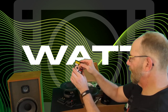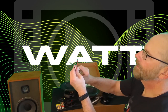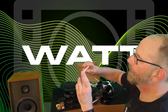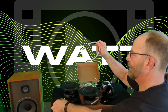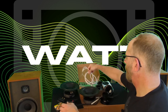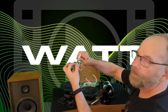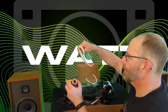For wiring I typically use Audtech 99.999% oxygen-free 14-gauge twisted wire from Parts Express — it's really thick and I've got just enough to jump from the terminal cup to the crossover. Then to feed the drivers, I've got Honeywell 16-gauge four-wire cable. I'll use the black and red for the woofer and the green and white for the tweeter, and solder these guys. I've got just enough for both cabinets.